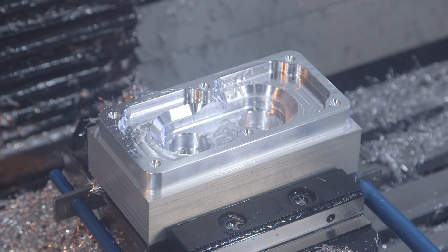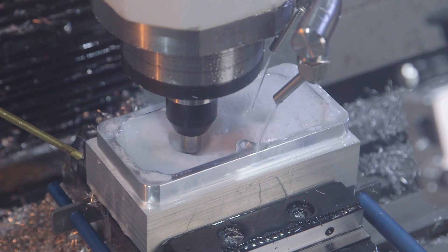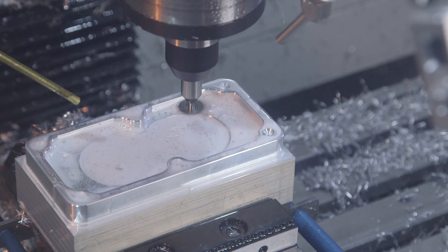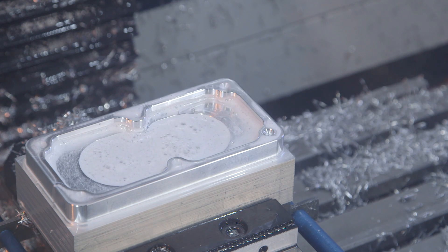So now we're on T5, our last tool. It's a 40 thou thick three-quarter key cutter. We're going to drop down in those pockets we machined earlier, start cutting away those chips. Looks good. And now that we're all done, let's blow this thing off and see what it looks like.